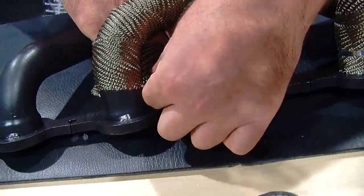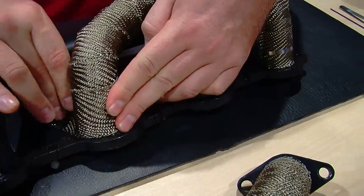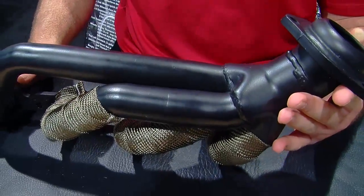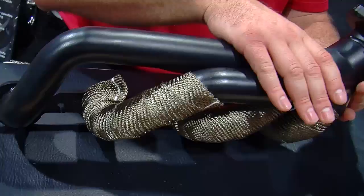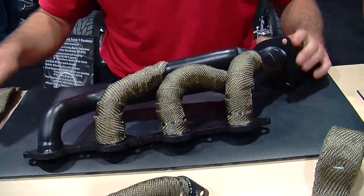You started from the bend going up to the flange — is that because that end is nice and square? No. You're going to notice that the pipes are too tight here. You need about an eighth inch of clearance to get two pipes wrapped individually. So I start here, wrap up, and then I can start again here, wrap them as one, and continue on.